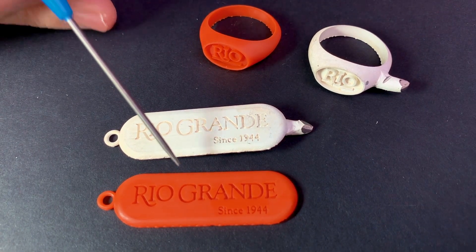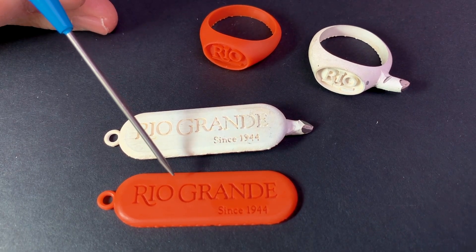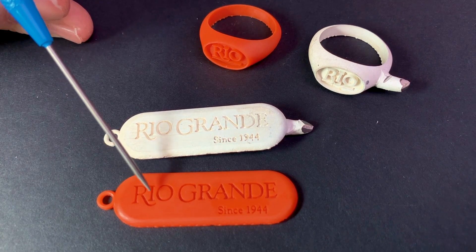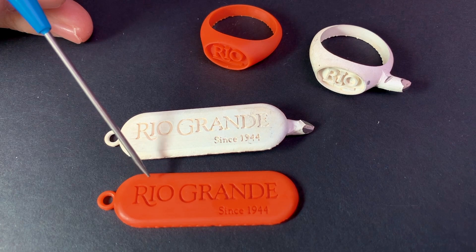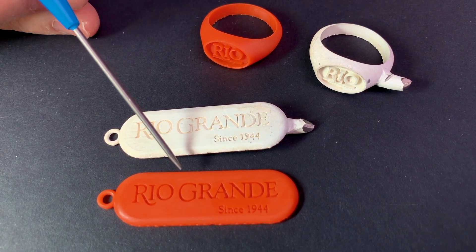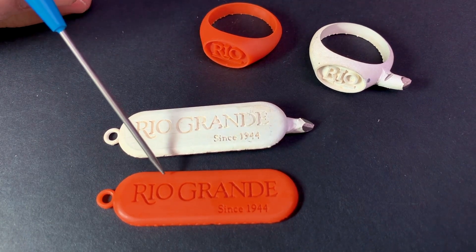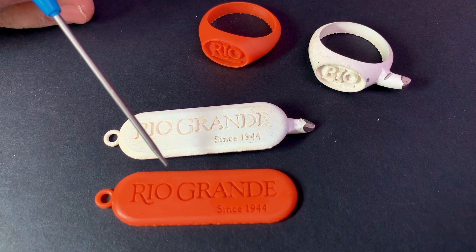If you made a mold of this, it would be really, really difficult to shoot copies from a rubber mold that were this sharp and this crisp. You would have to powder the mold and use vacuum and try to vent and stuff. And even then, you would lose a lot of copies — your success rate would be very, very low. So you would be better off to 3D print anything like this, anything with sharp, crisp letters. It's going to come out better.